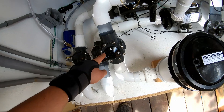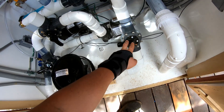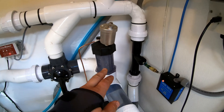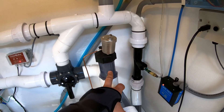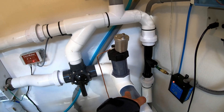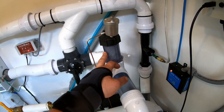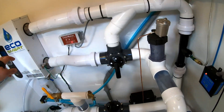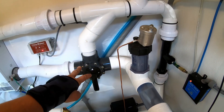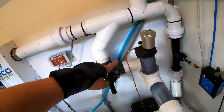Water comes out of here through a cutoff valve, through a union to the pool filter, out the pool filter to another cutoff valve, and up into the area where we have a sacrificial anode. The sacrificial anode basically provides a place for corrosion to occur — it's a grounded, bonded zinc anode. The salinity in the water will eventually conduct a little bit of electricity and things will start to corrode; you'd rather have the corrosion happen somewhere you can throw away than throughout your heater. This has its own air vent to make sure there's no air trapped. Water goes through a bypass valve which allows us to regulate the output temperature of the heater — even if the heater is fully on, we can add a little unheated water, though we don't really use that much.